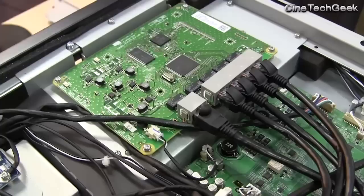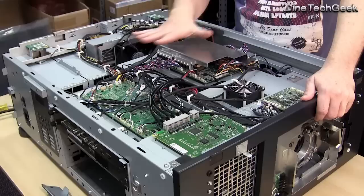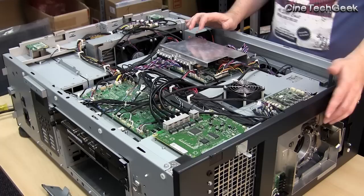Here's something interesting — this is like a little network hub. There are lots of computers in here: the secure media block computer, the IMS computer, and other parts of this projector. They appear to the outside world as one IP address, and that's done through this board here. There's one ethernet port but a few computers, and they all appear on one IP through this little box.